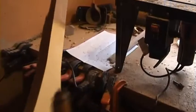But in this case, I'm just going to take it one step further, and I'm going to put an extra rebate in around the edge. And this is going to be for the binding. Now I'm going to try and match up. I've got a walnut strip on the back. I've got some walnut pieces laid on the side. And what I'm going to try and do is have some walnut binding going around the edge. So I'm going to rebate a step using a different bit.